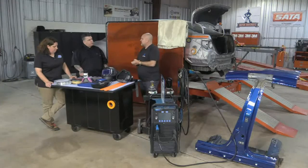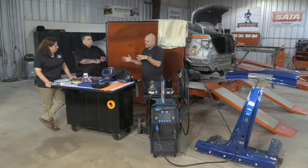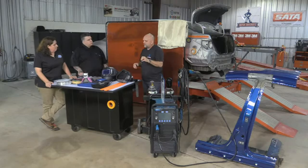And now to add even more to it, I've seen on some more recent late-model Hondas that they're using a single hole with MIG brazing. That's new this year. I believe it's on the new Civic, which went from 1500 rear rails to about 980, and there have been a bunch of changes. But one of the things I saw in the body repair manual was that single weld in there with the MIG braze as opposed to this.